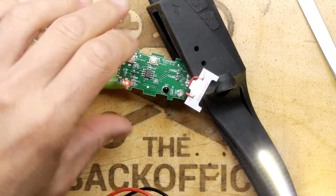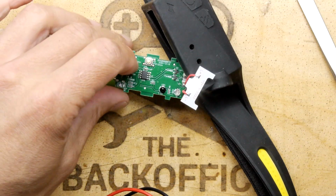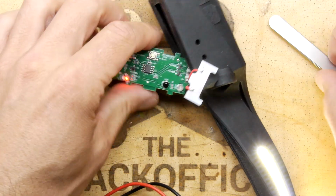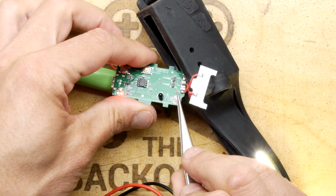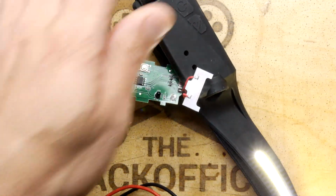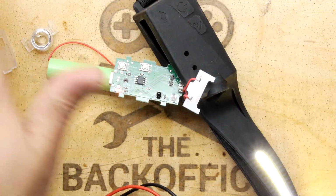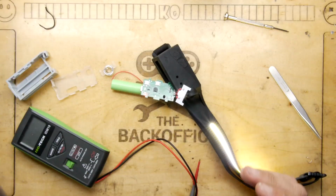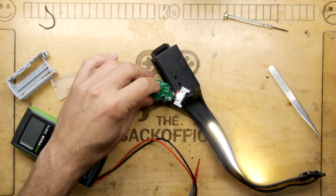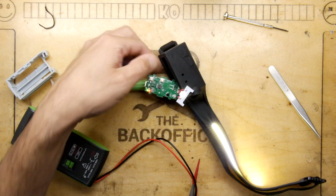But one interesting functionality of this, now I did read, was that it was supposed to be hand operated, one of these modes. And in that case, it says LEDs, but underneath them it says TX and RX. So it would be looking for reflection, so that it would detect when your hand goes past. So if you've ever had one of these, you're walking along and you swipe your hand to trigger it. It's kind of useful, but also obviously it's incredibly annoying when it's doing it when you don't want it to.